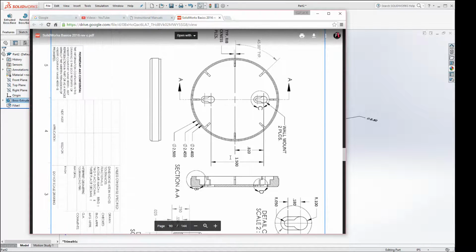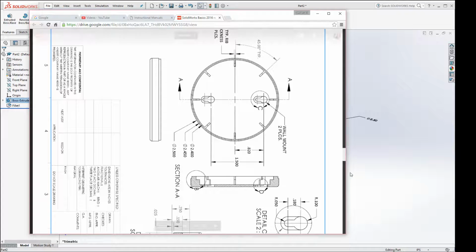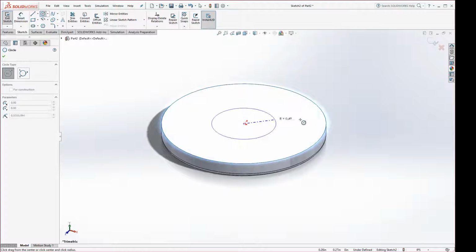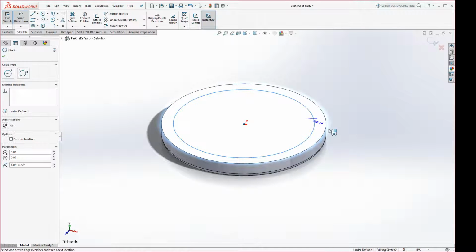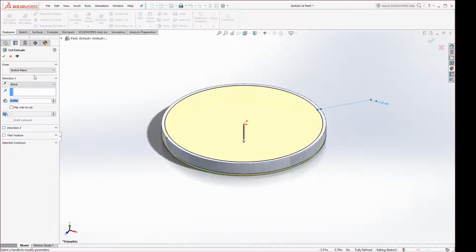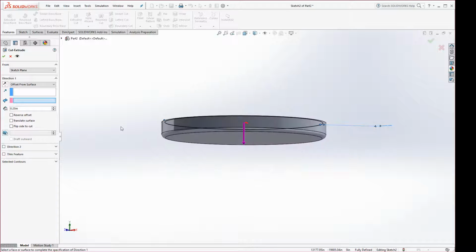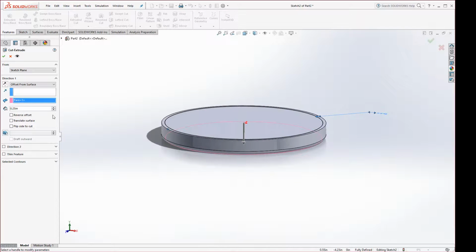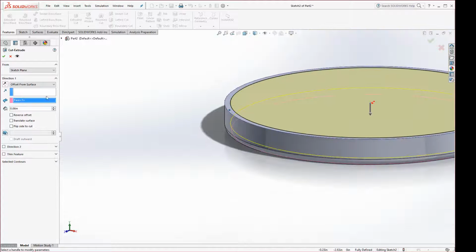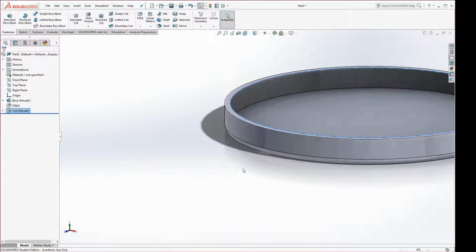So we're going to have to look at this 2.4. So select this face and start a sketch on it. Draw a 2.4 inch diameter for the cutout. And then go to Features and Extruded Cut. Now what you could do is use Offset from Surface. Select the bottom surface as your offset surface and have it set to the 60 thousandths, so 0.06. Hit enter, and you'll see the preview showing it's only going to go whatever depth it is and stop at that 60 thousandths.